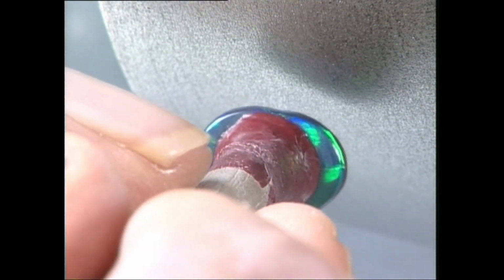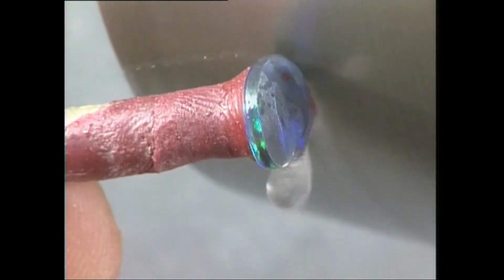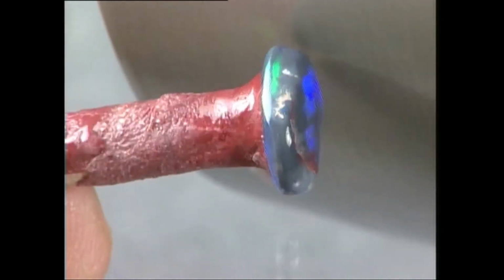Now we have to get rid of that so that we do not see it from the face of the stone. Do this by working at the same angle again and bringing the setting edge up very, very slowly, but very accurately. It must be even and straight. Jump over that bit of sand there. Take the high points either side of it. Just bringing it up gently.